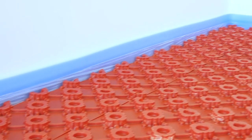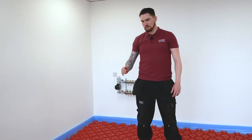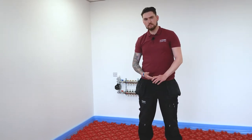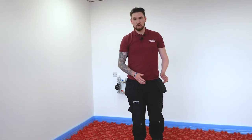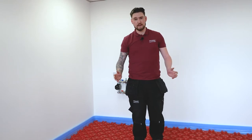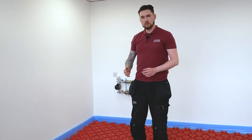Before we lay a circuit, it's worth mentioning a couple of tips. If we're doing a liquid screed, it's worth stapling the edges down to prevent the screed getting down the edges and lifting the panel. Also, when you come to screed it's worth starting in the middle of the room in the center of a panel so that the screed can pour out and displace evenly, and again prevent it from going down the edges and lifting the panels.